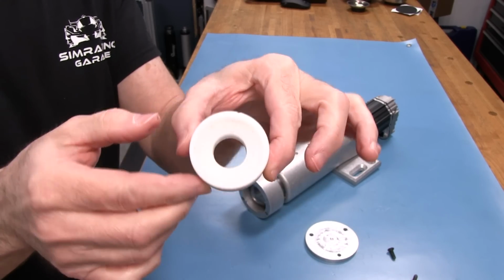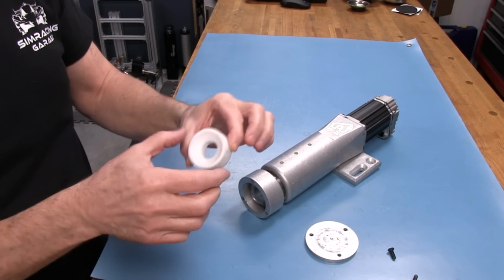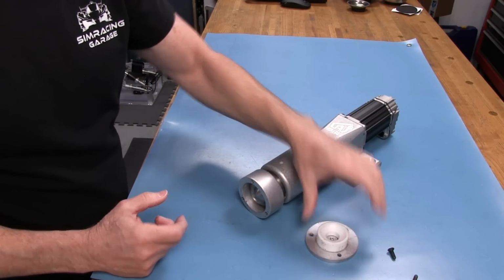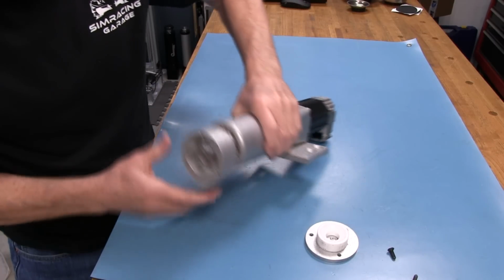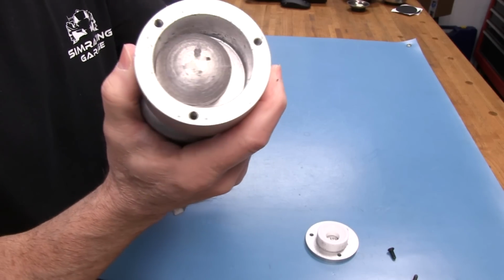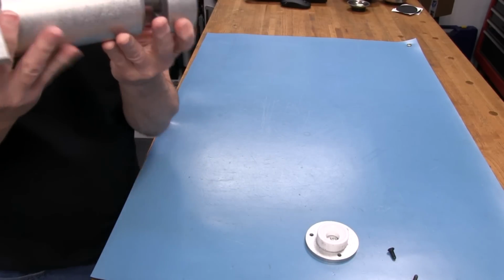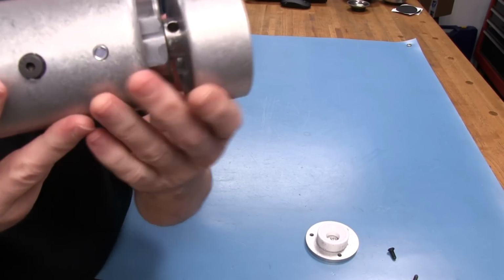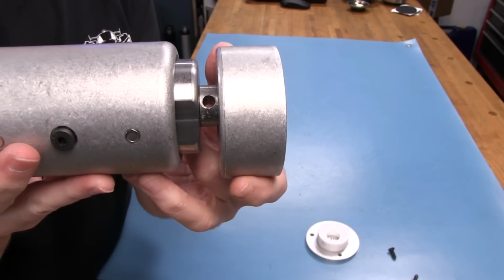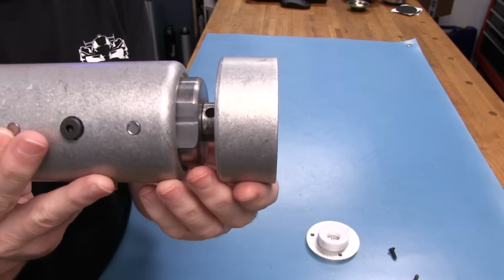And you can see it has a conical shape to it so that it fits on the foot in here. Of course, it'll slide around on our plate like this. And then here's the foot itself. And it has a concave shape to it, of course, so it can fit inside of there. And you can see the lube on that too. To get these on and off, I have this piece here. Obviously, they put some kind of a rod in there and allows them to twist or screw the foot in and out of the piston for maintenance and assembly.